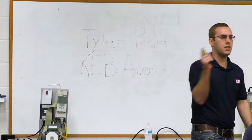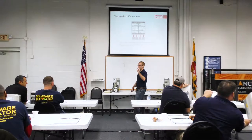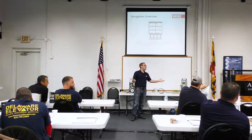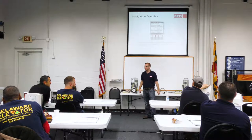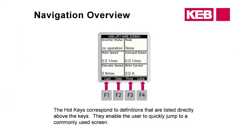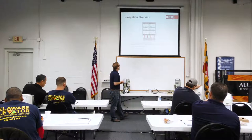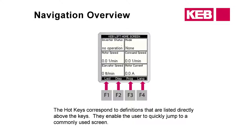As soon as the download completes it should bring you to the home screen. Is everybody at the home screen? The little LED indicator at the top is going to be red — that's because you don't have three-phase power going to it. We're just powered up with our 24-volt power supplies here, so that's normal. Okay, so a few notes on the home screen: the parameter groups for diagnostics, the most useful ones are on the home screen, and on the hotkeys F1 is last, F2 diagnostics, F3 for programming, and F4 for language.